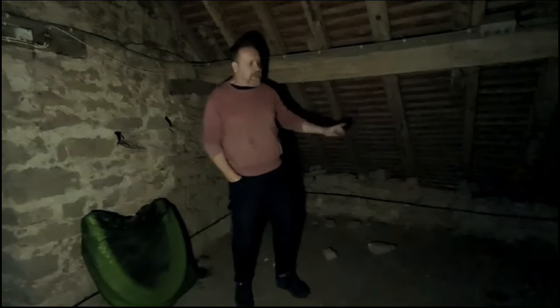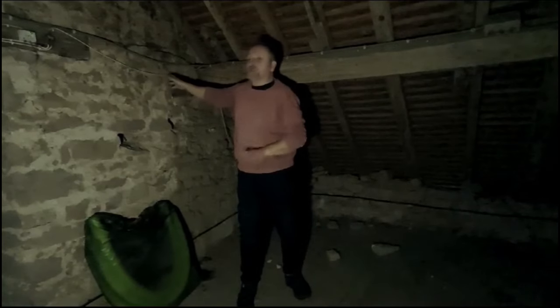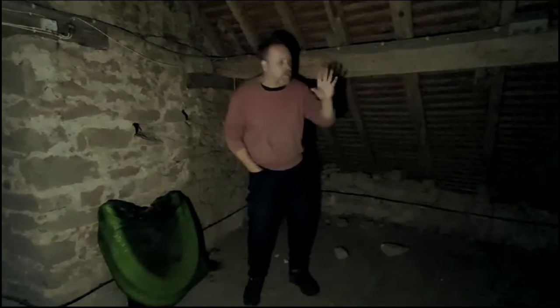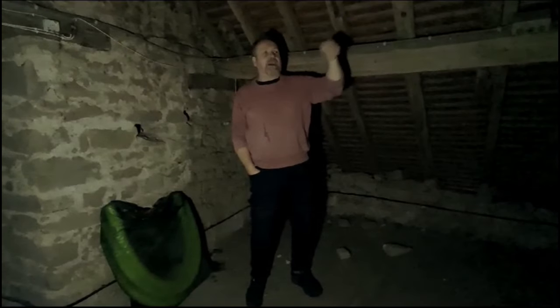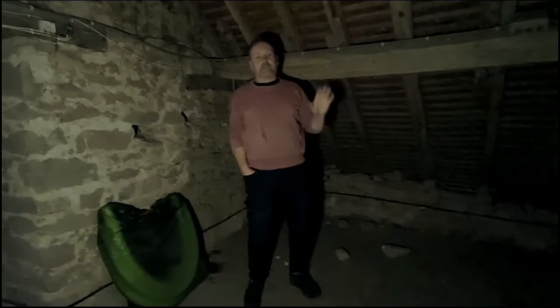I have one issue with the water, the actual mains water, which comes in on this side. The other side of this wall is apartment 3, or the loft of apartment 3, which is where there is a water heater already and there's mains water coming in. So the most direct route would probably be to tee off of there and come round, which is probably what I'm going to do, because I can run it down the side of the eaves here, and it just makes sense. And then all the pipe work probably over the other side of that A-frame, and the pipe work will have a shorter run to go down in there. So that's the idea, and that's what we'll have a look at, just to scout out.